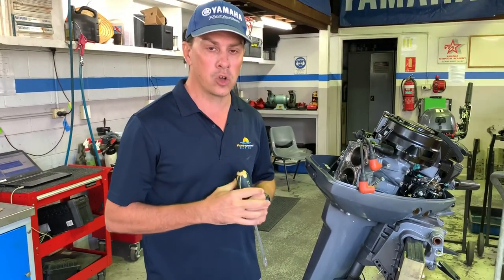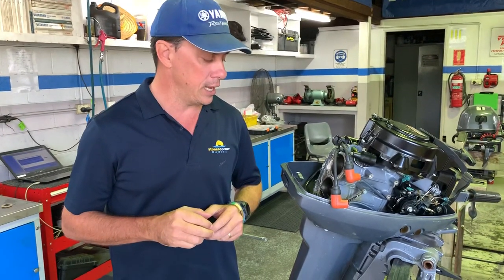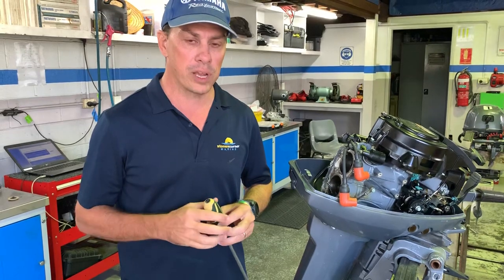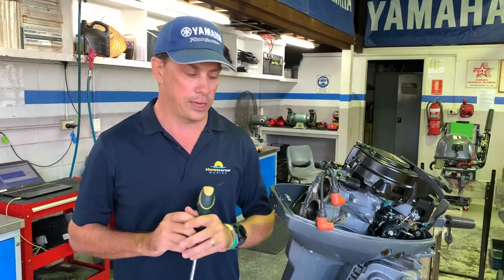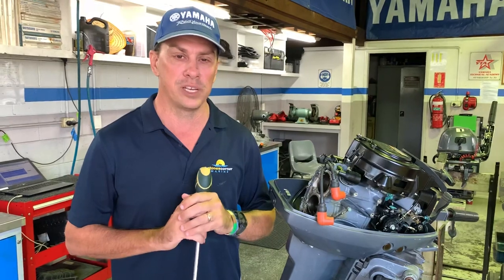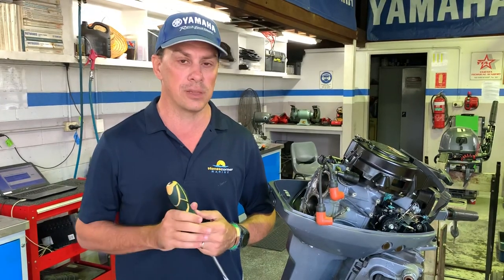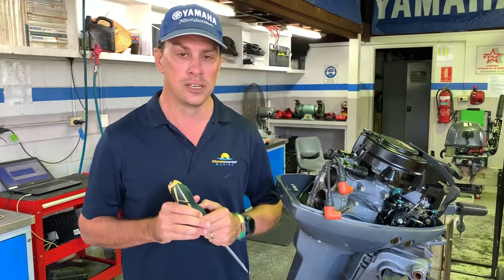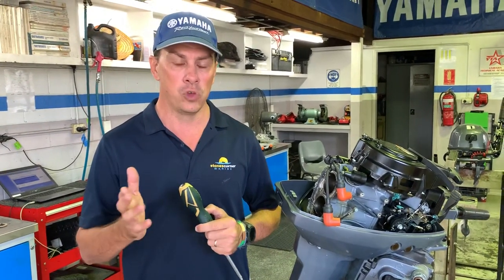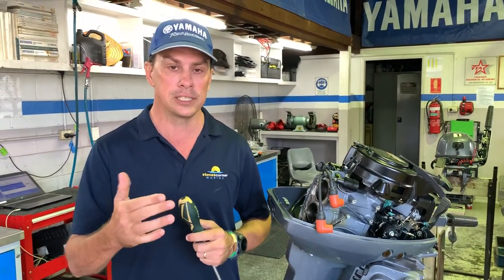That's all great but it comes at a cost that is avoidable, providing you're flushing your outboard properly. In accordance with most manufacturers, the recommendation is usually a 15-minute flush — yes, 15 minutes. I have customers every day tell me they flush their outboard for five minutes, but five minutes isn't long enough. Yamaha recommends 15 minutes, and I'm sure most other manufacturers also recommend a flushing process of 15 minutes. If you cheat your outboard and cheat your flushing, it will cost you extra money in years to come.